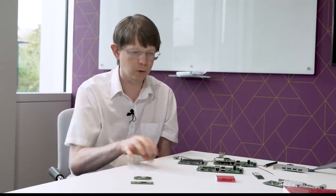And that's interesting. That's the same price as the cheapest Raspberry Pi CM3 or 3 Plus product. Yeah, absolutely. So same as that, but you now get a lot more technology on board. So before we didn't have the Ethernet PHY, we didn't have a wireless option, we didn't have RAM density options. They were all 1 gigabyte products, and we just had that 0, 8, 16, 32 gig flash option. And what we've managed to do is to equalize the prices of the equivalent compute module 4 products. Those 4 that overlap the older products have the same price point. Yes, they have the same price point, but we've also added, of course, the 2711 features in as well.